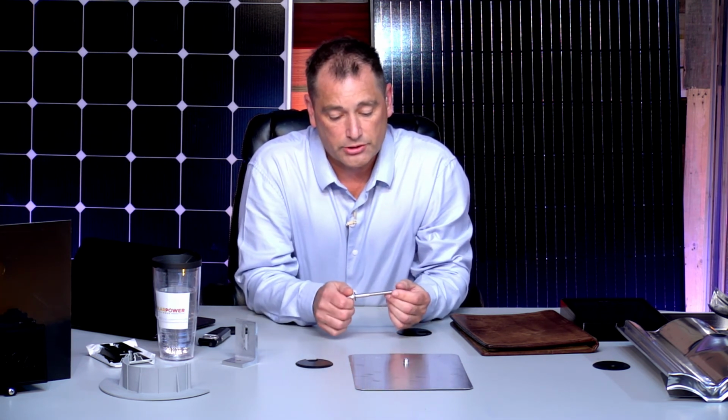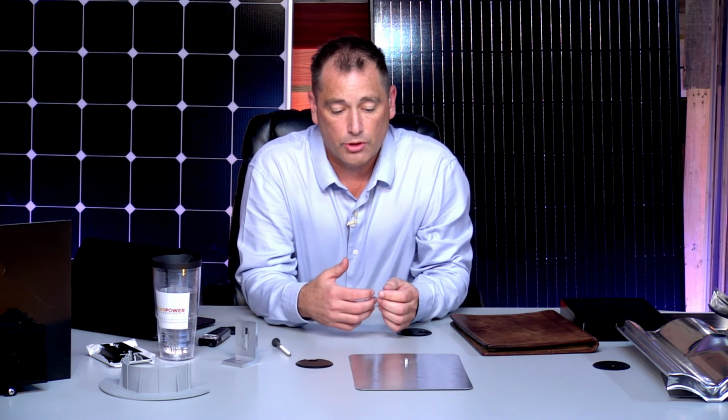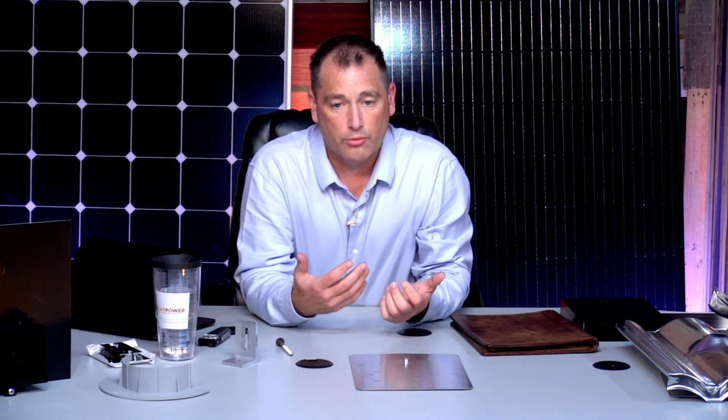And then on top of that it's bolted down with these lags. Like I said, these are 4-inch stainless steel lags that go into your roof and they go right into your rafter. You're not going to see these move. So a lot of people worry about the weight, and a lot of people worry about the wind. There's things you've got to worry about.